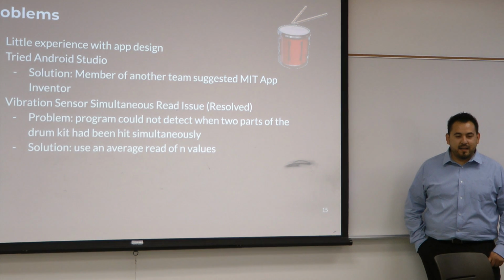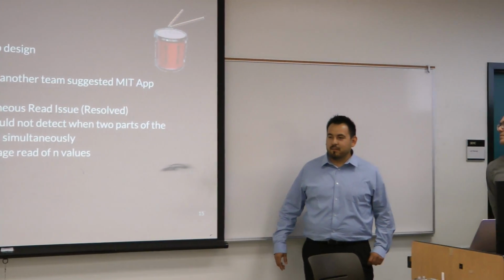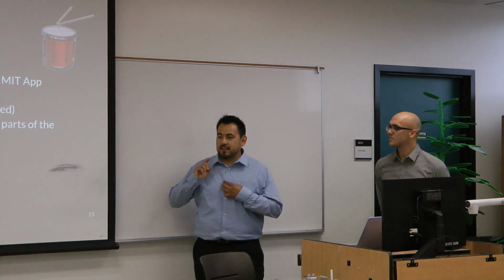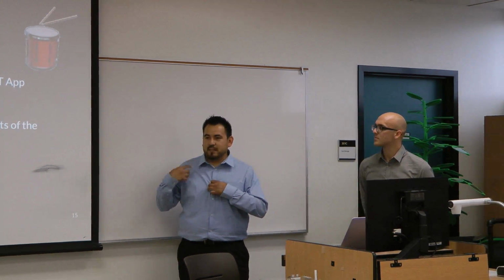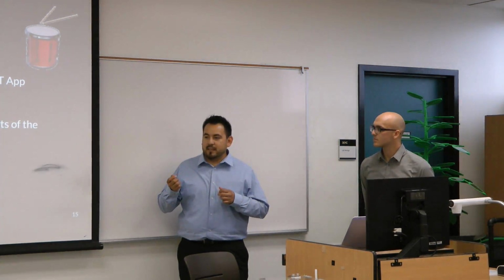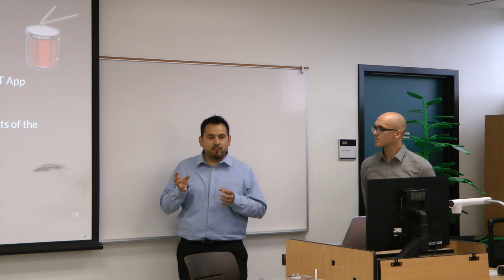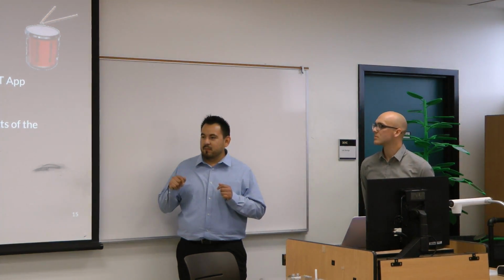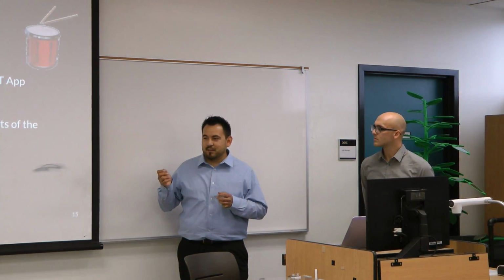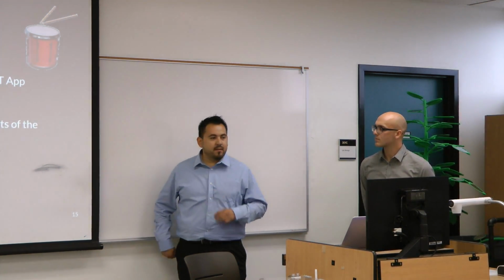And then another problem that we had was when we get the score back in the play along mode, we do it through Bluetooth. We send the settings into the board through Bluetooth, but we also receive data back. One of the problems we had was that we were receiving values that were basically trash, which we didn't need. I worked on the app for a while, and I had to flush all those invalid values to get the correct scores to display on the app.